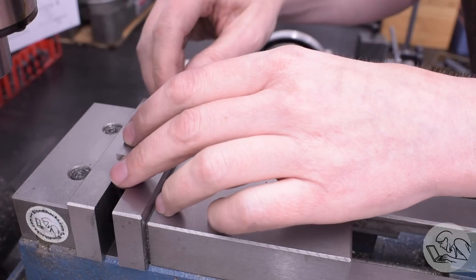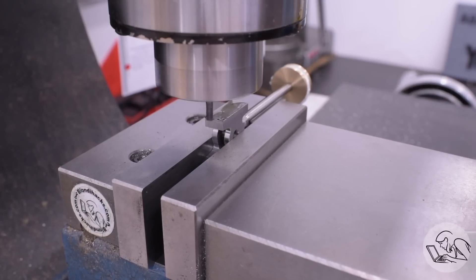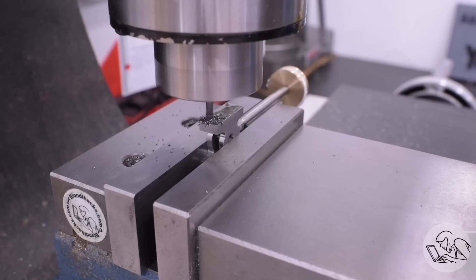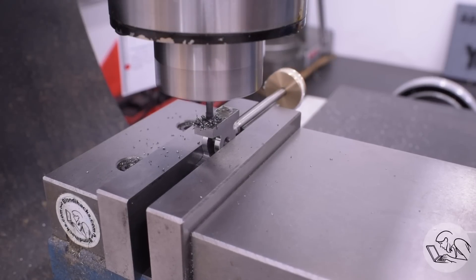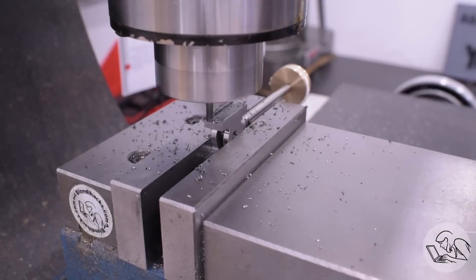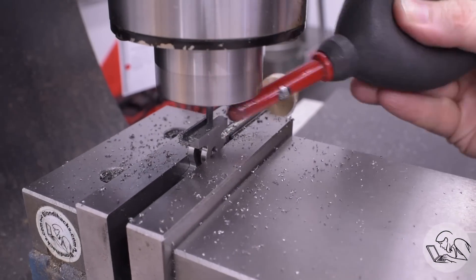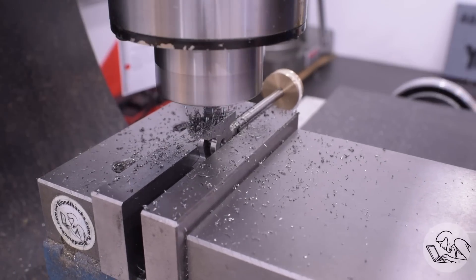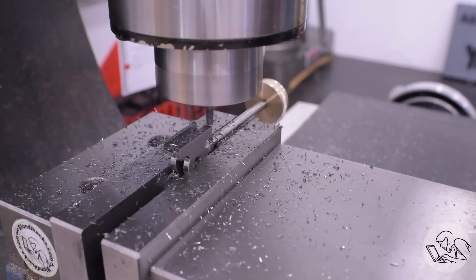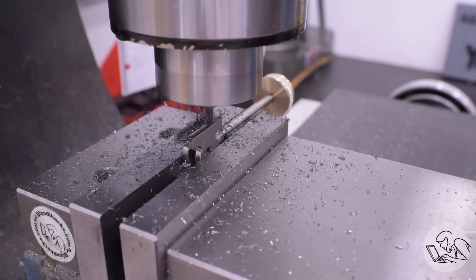It's important that we get these grooves well centered on either side of the piston rod because the crosshead rails will be centered on the piston bore — but that's difficult to do with threads as a centering reference. Threads are always a bad reference because there's a lot of tolerance in them. Kozo's idea here is that if we just use the piston rod, thread it into where it will be sitting, then wherever that happens to land — depending on how the threads were cut — that is what we want to center on. Using the piston rod itself as the center reference does make sense.